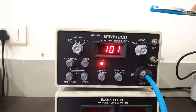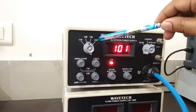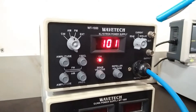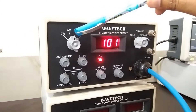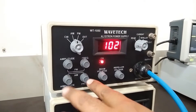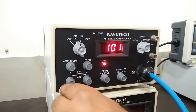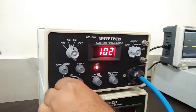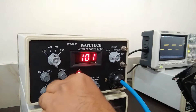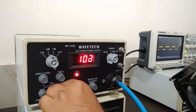This is the Klystron power supply, which has various knobs. First is the AM and FM knob. For the experiment we have to set the AM mode. If we change the amplitude knob, the amplitude changes, as we have seen in the CRO. And when changing the frequency knob, the frequency of the input signal changes.